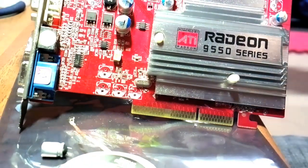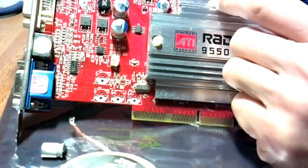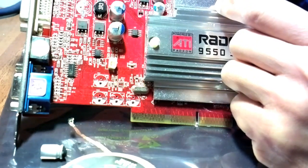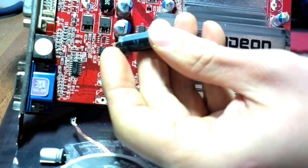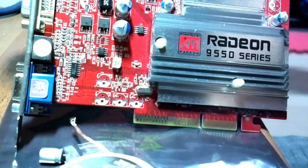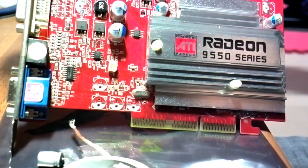So always try to work gently. Always pay attention when you are inserting the capacitor, because you have the polarity — the white part represents the negative, so you need to match it with the side that's striped. If you reverse the polarity, the capacitor may blow up again.